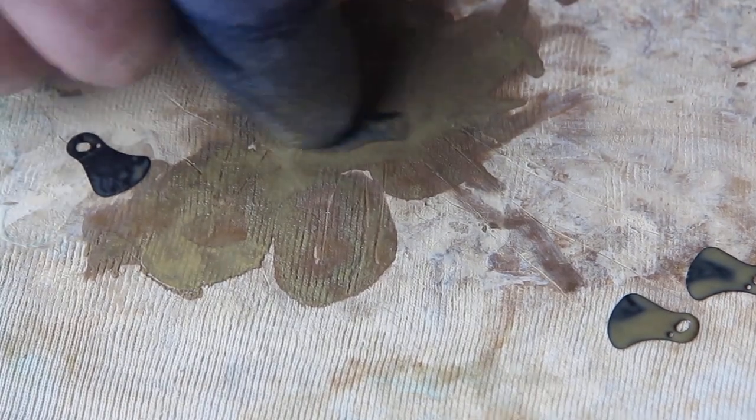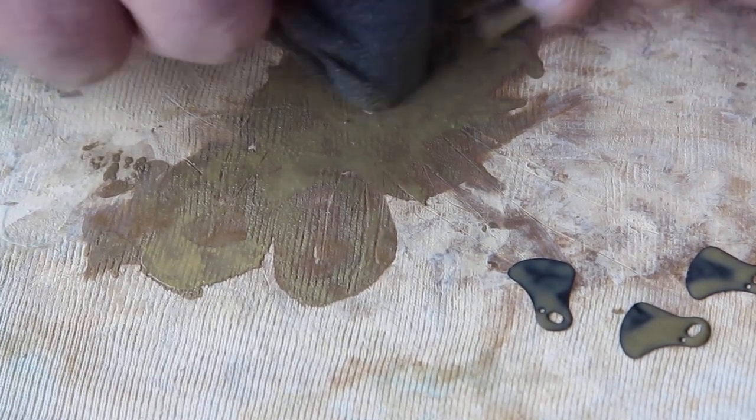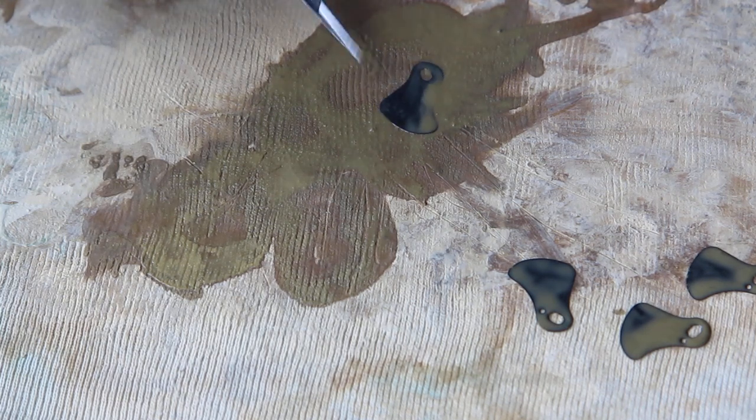This sort of thing is easy to do with shutter blades, and there's fairly minimal risk of damage. Diaphragm blades, because they have rivets on them that form the pivots, are vulnerable to damage if you try and do something like this. I rarely do anything with diaphragm blades of this nature. If they do have to be polished, because they have quite a bit of corrosion on them and I need them to run very smoothly, as in a Retina Reflex. The original Retina Reflex, of course, has diaphragm blades in the shutter, and they need to snap down to the preset aperture when you fire the shutter. And so in order to do that, they need to be very smooth in operation.